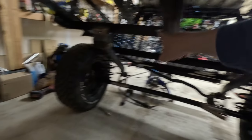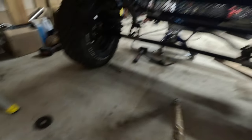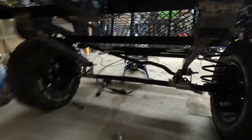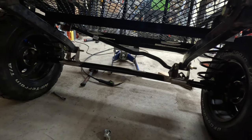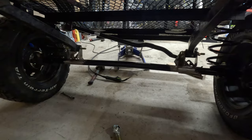I'm going to weld it there and box all that in on the same side. That way these two mounts are super solid. I'm going to come down here where I've got it shaved down — I've got these brackets — I'm going to box these two lower brackets in and then build a lower link that's going to keep that axle from wanting to wrap and twist. That's going to put opposing force on it. The only way it would roll is if something hit the tire hard or you hit a pothole, and I just don't want it to roll on the trail.